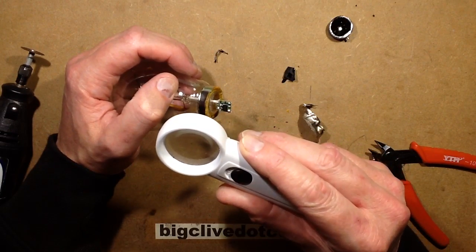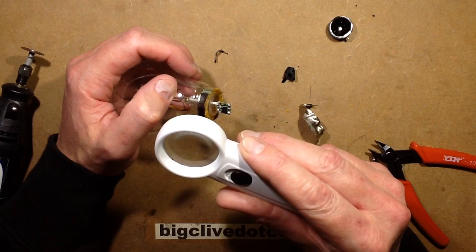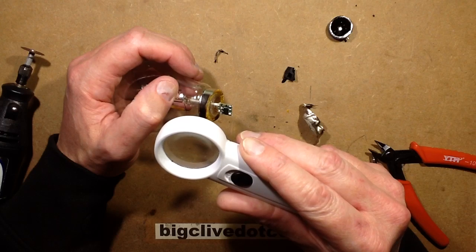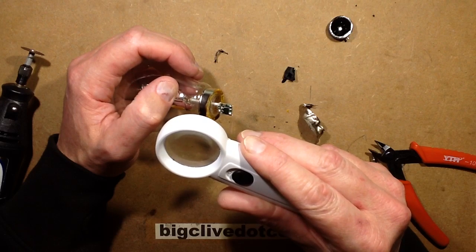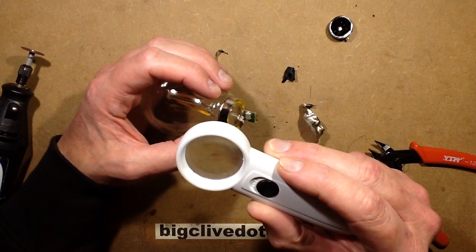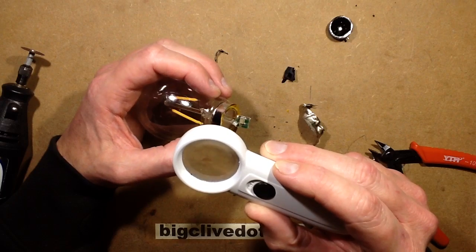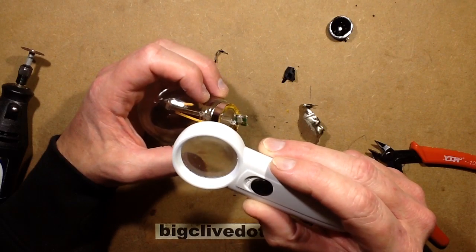There is a little resistor — or is that... that's a load resistor. That's 204, so that's 200k. I shall draw the schematic for this out right now. And the other one is 304 — it's across the dropper capacitor, so that's 300k.